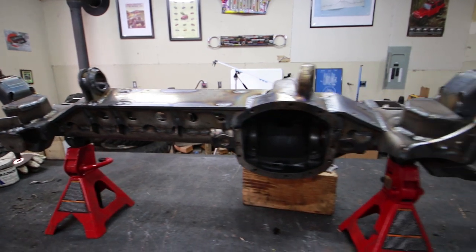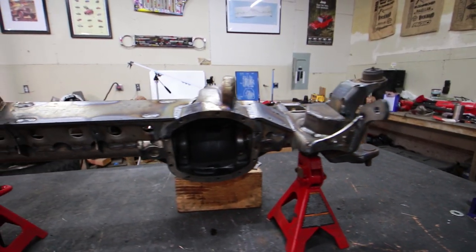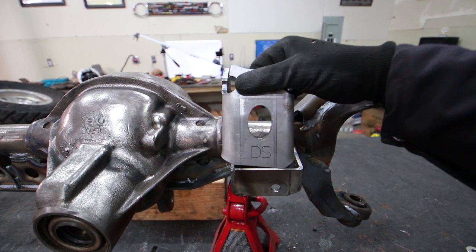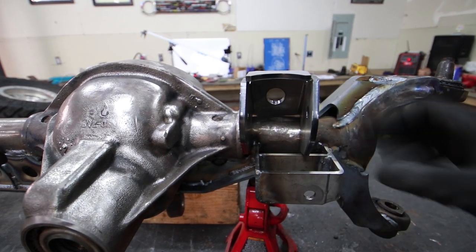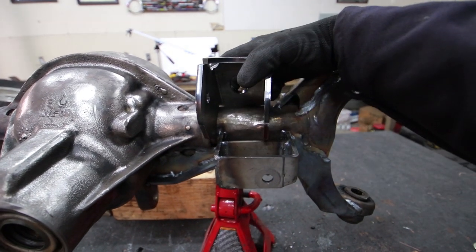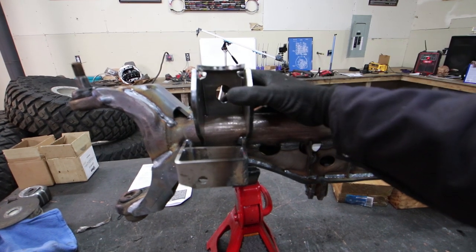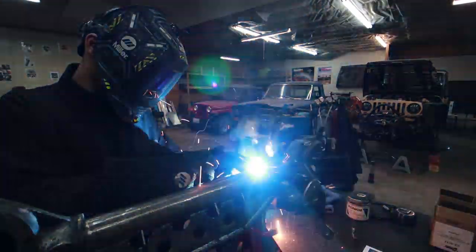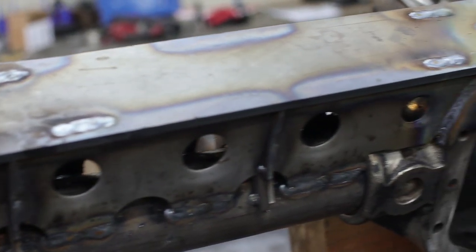Holy cow, that's a lot of work — let's see how we did. I went a little out of order from the instructions but it was based on my best judgment and it all went together fine. We had no issues really, other than the exploding ball joints, but everything else was great. The only two brackets we have left are the lower control arm brackets. These are straightforward — DS is driver's side, and per instructions the inside sits about a sixteenth of an inch away from the outside of that bracket, tilted so the gap is also a sixteenth. Same story on the passenger side. This axle looks so much better with a truss — much beefier, not worried about bending it or tearing off a bracket like you would with a stock XJ or TJ axle.